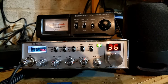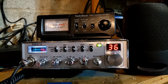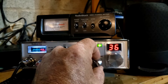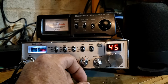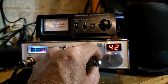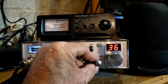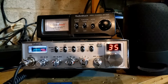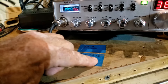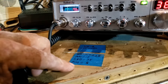It's a maybe 200-watt amp, peaks maybe 225. What I see on the meter is usually around 200 watts. This radio is great for an amp like that. I can run the output power at full blast, but I don't really feel the need — it only adds maybe five watts. So I crank it down. I have a little cheat sheet: QT40 plus the 225 amp — on AM the power level is set at 15, on sideband at 35, and on FM at 5.